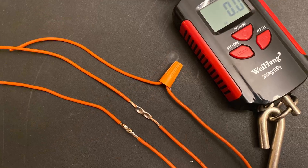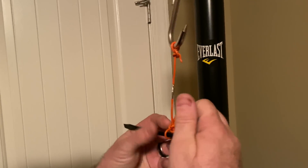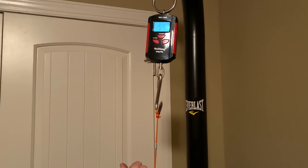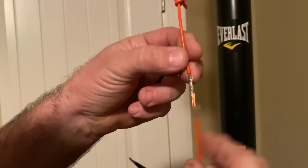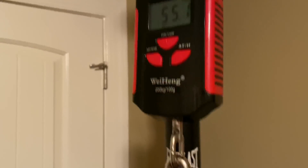Okay, let's do the pull test. I've got some knots tied in these — a version of a double half-hitch loop, Boy Scout knot — and I'm going to pull on them and see which one pulls apart first. First is the solder joint. I'm pulling on it — it broke right below the solder joint, at the stiff part I was thinking about earlier where it got overheated. How high did it get? 55 pounds. So it broke at 55 pounds.